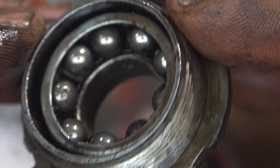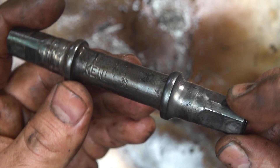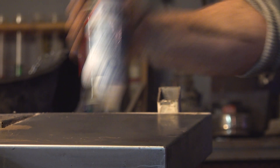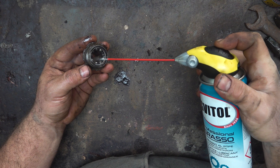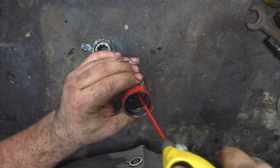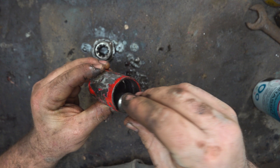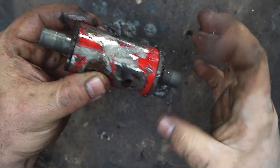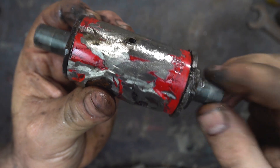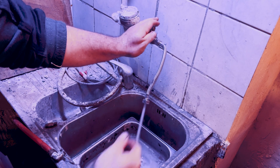You can see that finally all the parts are shining just like new, and this will sure give us a very smooth effect on the camera movement. I chose some PTFE grease because my shop is very humid and there's a lot of dust in the air — I think this is the best solution. I close everything, test the movement — it's so smooth, just like new. The part is perfectly clean with oil and grease, and everything spins very smooth.